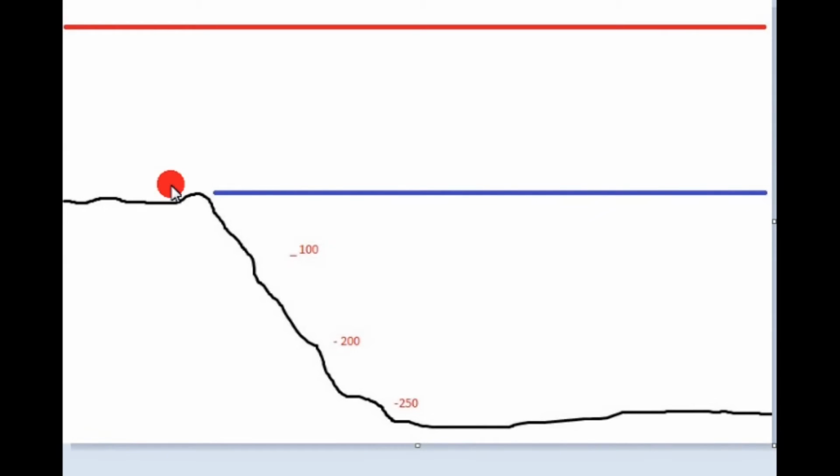So you set your home point, quad starts up. The blue line is the 0 point, the ground level. And the red line is saying that that's your return to home height. For me, 100 feet. For you, whatever you set it to. So you take off and you fly around like this, and you're having a good fly around. Then for some reason you decide you want to run down this mountain to this point here. Okay, your quad's still flying around up here, and you've moved down to here.